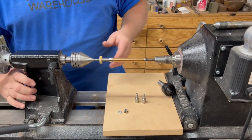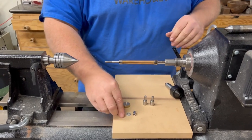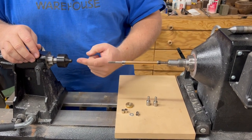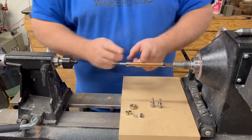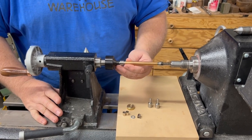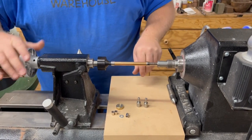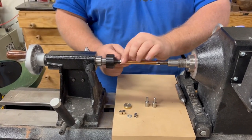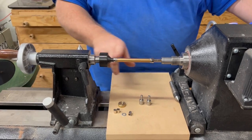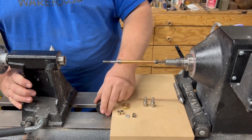There's one really cool upgrade you can make that will save you headache and time taking this nut off and on, and that is using a mandrel saver. What that does is it replaces your live center. The shaft slides right into the mandrel saver and all the way through, so if you had a really short tube with a lot of mandrel, you wouldn't have to put a bunch of spacers — you can slide the mandrel saver right over the shaft and up to the bushings, lock it down and you're ready to go. The beauty is that the mandrel saver is pushing on my bushings, not on the end of the mandrel causing it to bow and get out of round. This will keep it nice and straight. The mandrel saver is something I'd recommend getting right away because it will save you a lot of headache and potentially some mandrels.